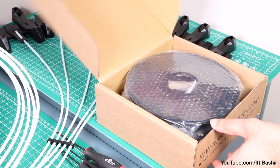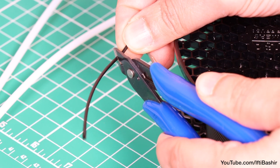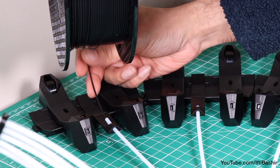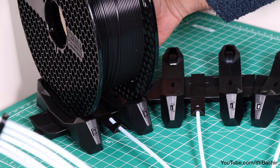The first step is to load filament. I'm using PLA for the moment. Cut each tip so it's relatively sharp, and straighten the ends as much as you can before placing on a filament spool, with the end feeding a little into its respective PTFE tube, just so the spool doesn't tangle itself.